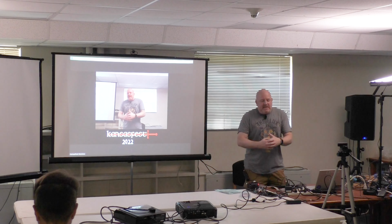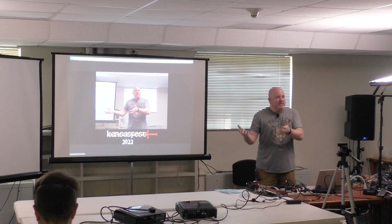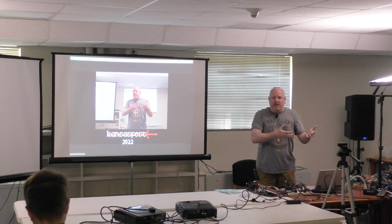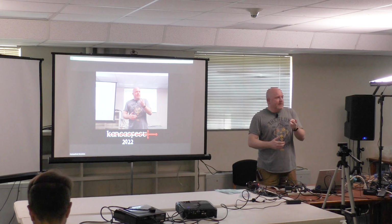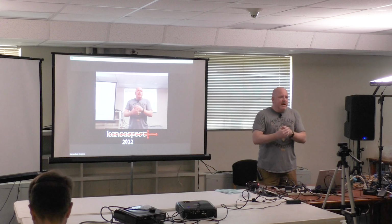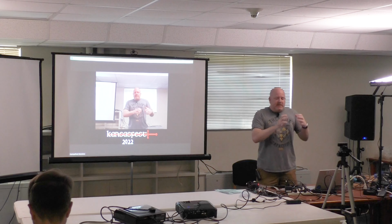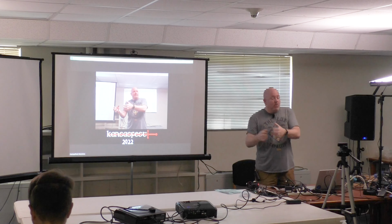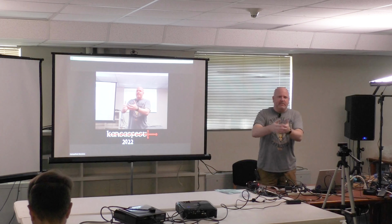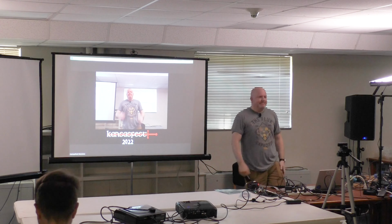I didn't doubt that the Mega 2 worked, but it occurred to me, why did they call that chip Gemini? Why wasn't it called Mega if it's just a Mega? By the way, I didn't get into it, but on Tuesday, right before I drove down here, I found out that there are two versions of the Mega 2 chip, and they don't work identically. The video signals are slightly different, and I don't know why yet. Early on in the project, my suspicion was, what if the Mega 2 never worked? What if that was the reason it ended up in the 2GS? Or when it was decided to cancel whatever the follow-on to the 2E was going to be, what if they never finished it? So that's why.